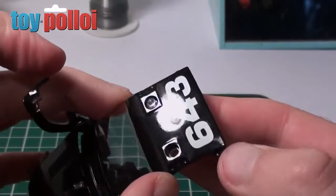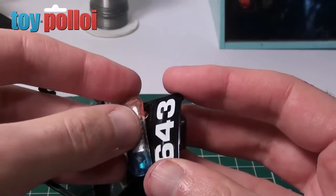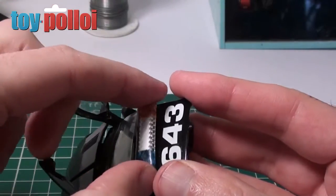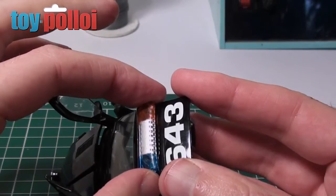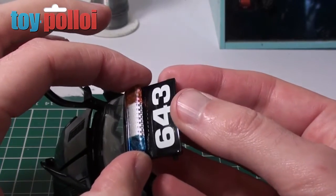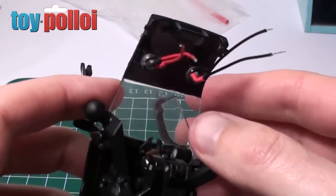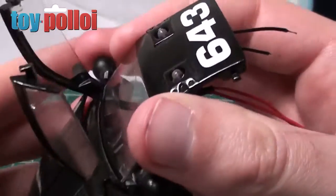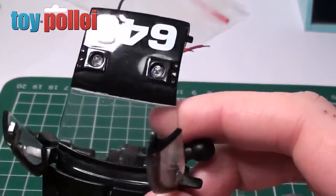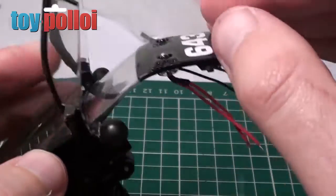I now have space to fit each LED neatly through the hole, and the light section still just about fits on top. I'm going to attach wires to these LEDs so I can glue them in place and reattach them to the circuit board. The LEDs are soldered with wires and pushed into the two holes. I'm keeping them the same orientation as original — Barricade is supposed to have a red light next to the number six and a blue light next to the number three.